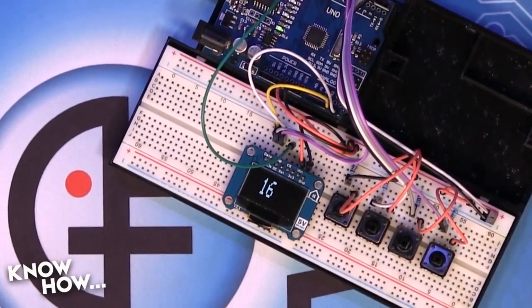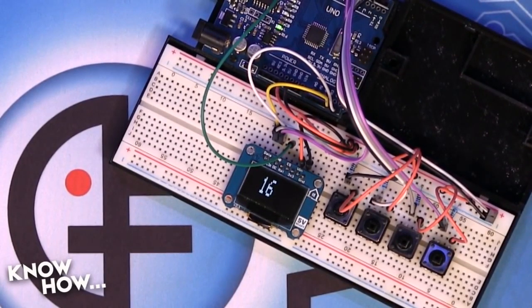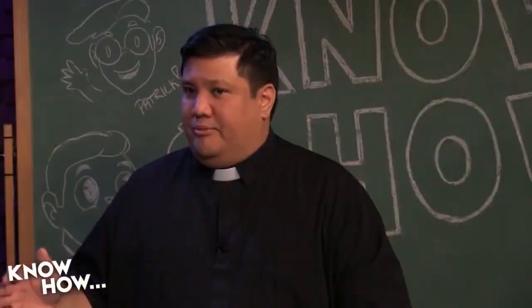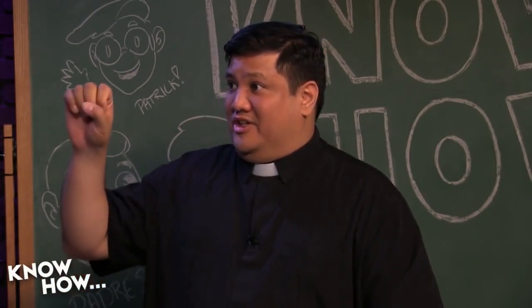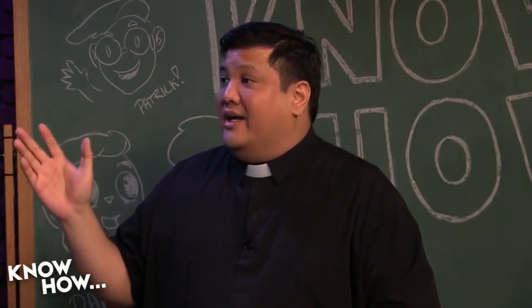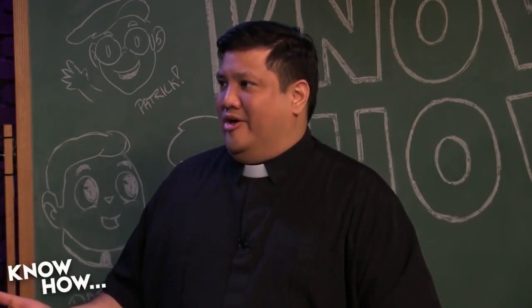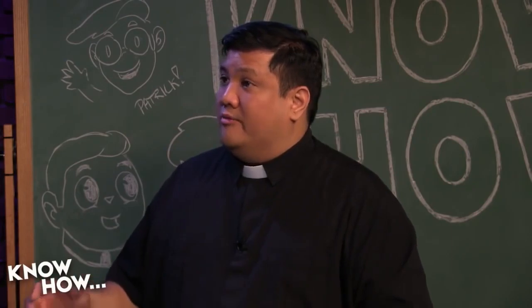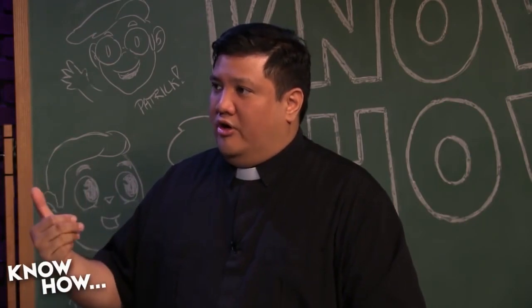All right. So this is where I want to store any persistent information. So for example, in our Growduino, I'm going to be doing input where I set a grow time, or a watering time, or a lighting time, or whatever it might be. Fertilizing time. I don't want to have to re-input that every single time the thing loses power. It'd be like your VCR flashing 12 all the time. It works fine as long as you don't lose power. Well, you could buy a UPS and keep the thing battery powered at all times, or you could write it into your program so that every once in a while, when it needs to, it saves to memory, and then when it boots, it recalls it from memory.